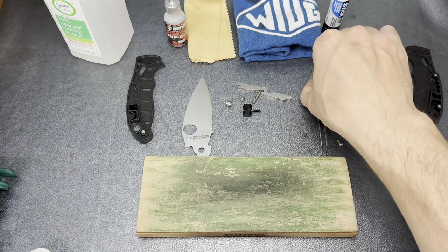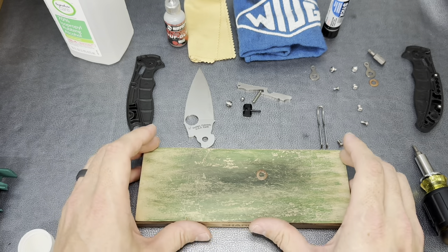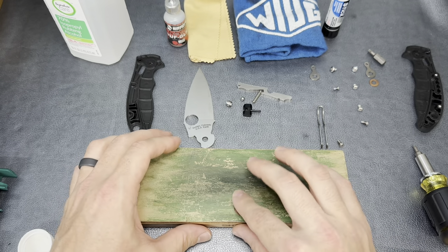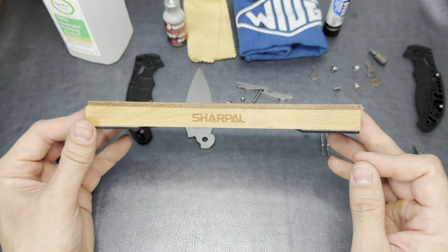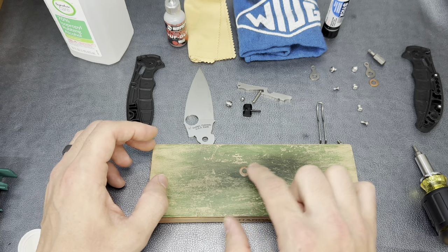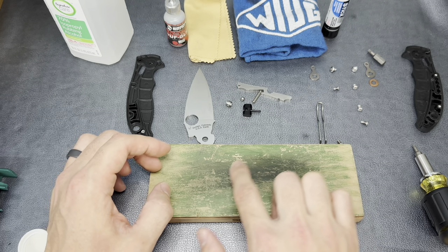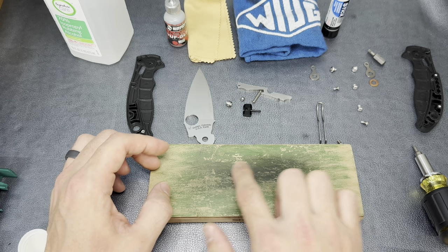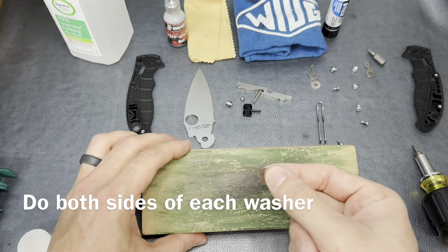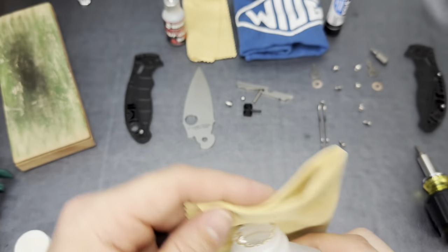Now this part I am going to slow down because I do want to mention what I'm doing here. This has seemed to work for me pretty well in the past in getting really, really smooth action on knives that use these phosphor bronze washers. What I do is I have a really flat stropping pad — it needs to be very, very flat — attached to a wooden block, as flat as I can get it. I put my finger over this phosphor bronze washer and just kind of do a circular motion. Find yourself a nice flat spot on your stropping pad — mine is kind of beat up, I am in need of a new pad here pretty soon.